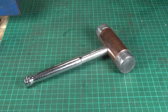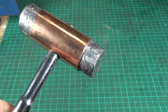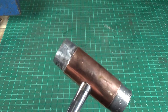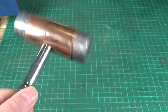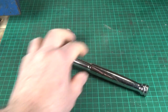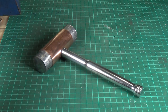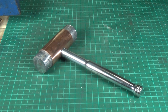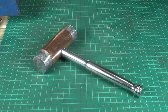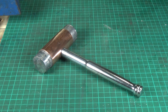Here's the finished hammer — I'm not too unhappy with it now. That's the good end, which turned out quite nicely, and that's the bad end. I used some lead-based solder to fill the holes which has tightened it up a little bit. I think it could probably have done with a longer handle, but it's proved that the principle of the thing works. I'm going to have a go at making another one — I've bought some little lead ingots off eBay, so hopefully that'll be decent lead without any impurities. I'll probably use a larger hammer on the next one.